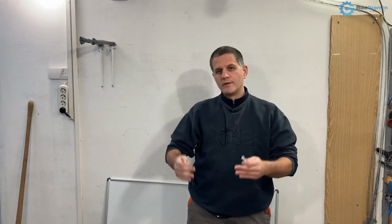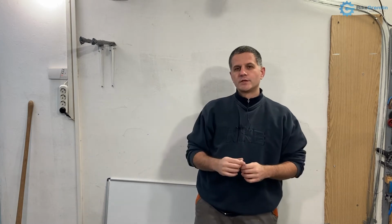There are different designs of dowels. They work differently depending on which material exactly you are going to mount them in. So you can go to your local hardware store, if there's anyone who knows what they're selling, ask for advice and tell them what you're planning to do: the mounting method, how many screws are going to be used, how heavy it is going to be, are there going to be any sudden movements, pushes, pulls or something, is it going to be pulled away from the wall, that also makes a difference, and so on. That's a general story.